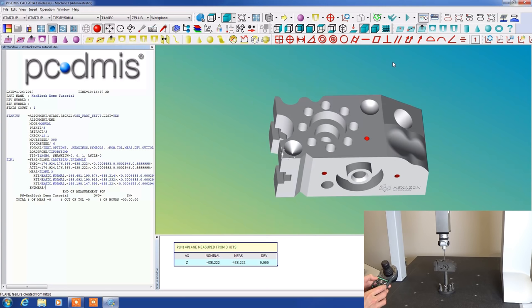So we're going to move on now, we're going to work with our second plane. We'll bring this down, and we can touch it against the side here like this. Move it down a little deeper, touch it again. Now make sure when you contact it, you don't contact at the upper part of this shank or you get an erroneous hit information. So again, we are ready with those three hits. We accept it. We now have plane two.